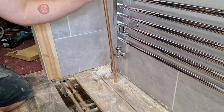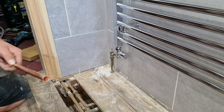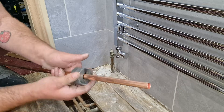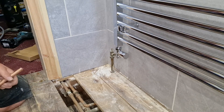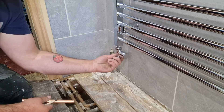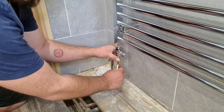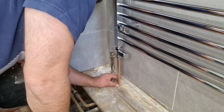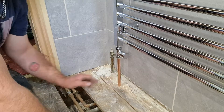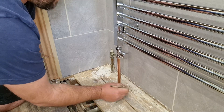A bit of copper — simply place it on the floor and hold it just to where it goes into the valve. Take your pipe slice and just cut that piece off. I'm going to use this as a guide for where to drill our hole. Take the nut and olive off, just place it over, add it in and rest it onto the floor. Make sure you square it up so it's nice and straight with your pen or pencil. Do a line in the front, a line at the side.